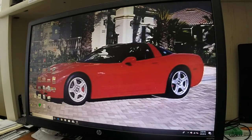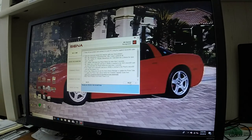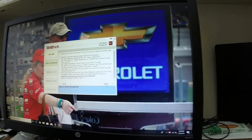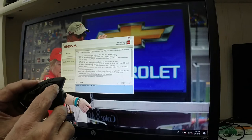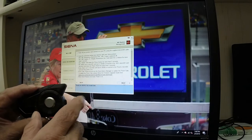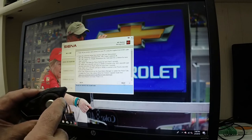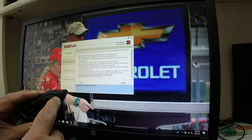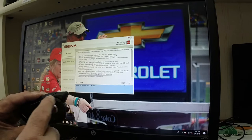The software leaves an icon on your home screen that says Sena — that's the one you double-click. Here comes the firmware update program, and it shows a few of the devices Sena has for sale. Click next. It says power off your product. The way you know the product is powered off is there's a little triangular window up in the corner, and if there's any light in that window, it's on. If I turn this on, you can see the light. When it powers up, it'll blink some lights — one, two, three, four. Those red lights that blink when powering on tell you how much battery you have left. Mine is fully charged right now.